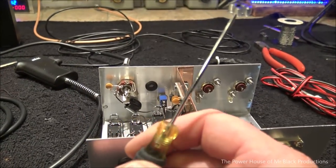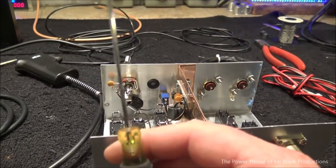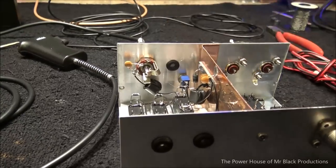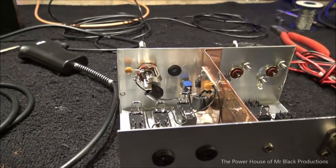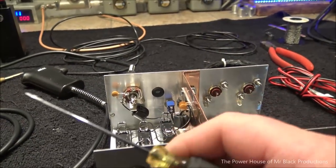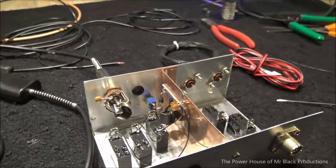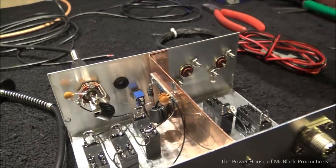Otherwise, your radio is going to be slightly deaf when you come off transmit, and then you have to wait for the receive to come back up. Meanwhile, your guy is talking to you. My guy likes sideband. So, needless to say, you follow where I'm going with this now? When he's on sideband, you've got to have receive almost immediately. You can't wait for it to slowly creep back, the receive to come back with the AGC automatically adjusting itself. So, okay, now that we've got the ground side done,